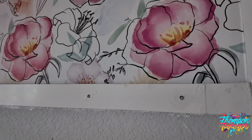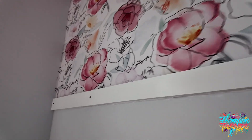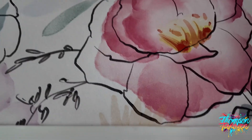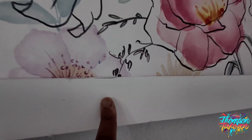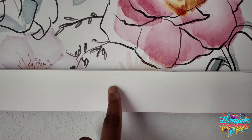As you can see I sealed the cracks so it looks flush, with the mold all the way down the board. It's still kind of wet so I'm waiting on it to dry. My next step will be to sand the screws so they're flushed in with the board, then go over it with some putty, paint it, and you'll see the final touch. This is day five of this project.